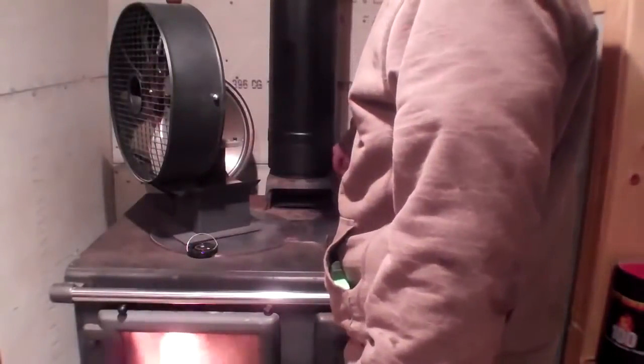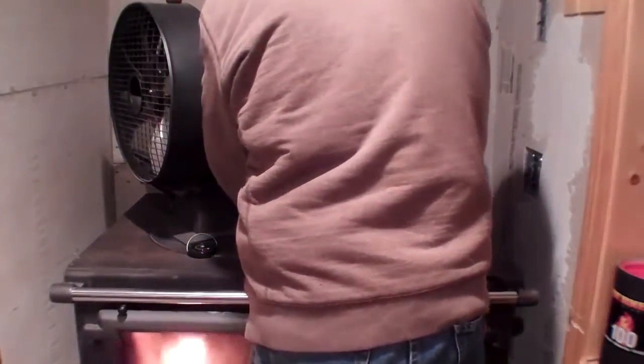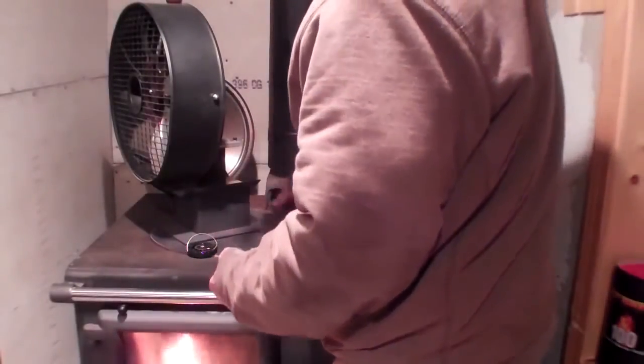With the ESSE, there's an upper damper in the pipe where you can shut it off. Then there's this little plate with some insulation on it to help hold the heat in the bottom base of the chimney. And then you have a cast iron piece here that sits over. A lot of old time stoves used to have these. Also you can clean your chimney from the top down, shut this, and then vacuum the stuff out. So if you can, close that off the best you can because you don't want all that stuff going down in there.